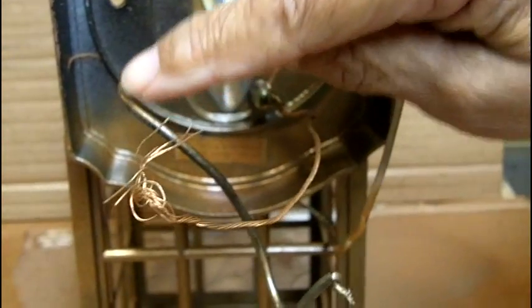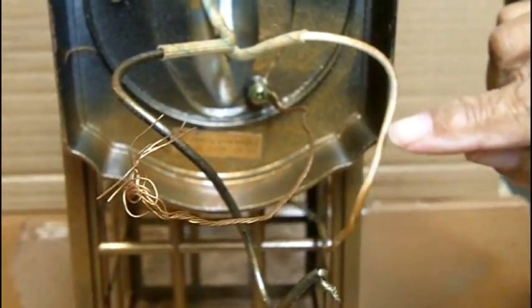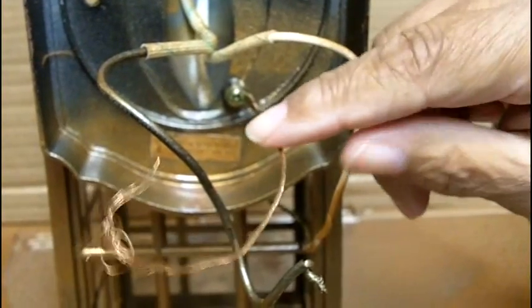Okay? Our next wire is our hot wire, and it's denoted by the black sheathing. Our white wire, well, that's our neutral. And just keep in mind that white to white, black to black, and then, of course, like I said, the ground wire is going to be attached to a green grounding screw. Okay, so now it's been wired. I'm going to stick the wires back in the box and then put the lamp back into place. So next I'll put in my glass, install the light bulb, and put the cap back on.